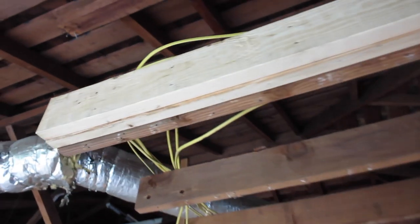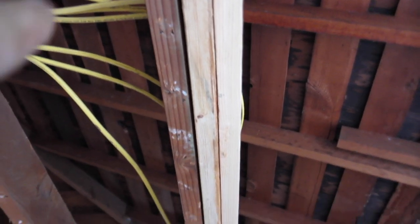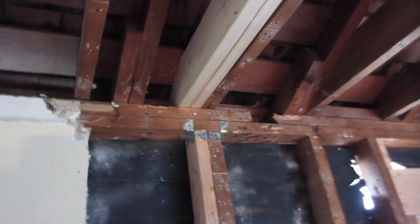But there's 2 other beams you'll see down the center of the house that's going to go on that big post in the middle. These other beams were going to hang on that beam. So now the triplers are going to hang on that beam. And one of them is still in the outside wall. We had to move it in because we needed that structural beam. So that's what's going on. We built a tripler out of 2x6. Why? Because the 2x6 existing already has a back cut on it. So we do 2 more, sister them together, same back cut, and then there's a nailing schedule. So we did that 3 times. They added 1 more work. That's okay. That's better than putting in 2 beams through the roof.